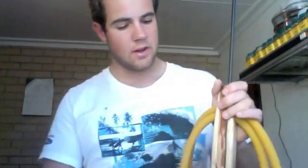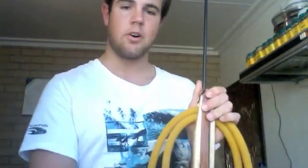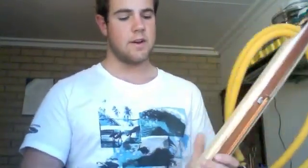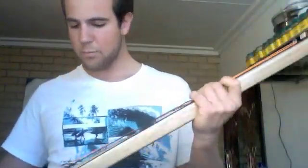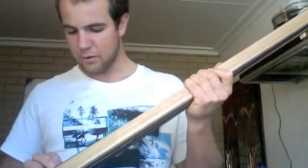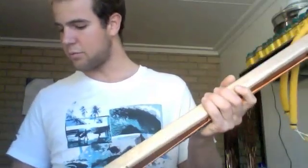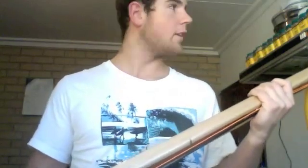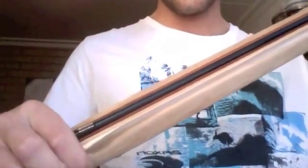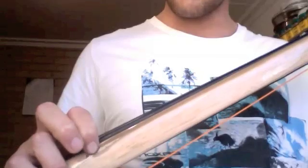After that, for this gun, I put a little chamfer on the router and tried to router out the edges to make them nice and round. One problem with that, because I don't have the highest end tools, I've got good tools, but obviously I'm on a budget. The ball bearing, the circular bearing on the end of one of my router bits came off. You see the discoloration of the wood just here. That actually just dug into the wood and took a whole lot out.